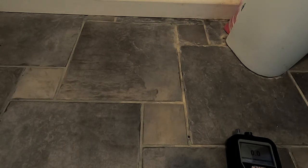When it comes to measuring moisture on concrete floors covered with these sorts of tiles, especially in a property that's been empty for a while or has no heating, or even a few years after a flood, one of the causes for concern would be the potential for condensation on the surface of those tiles, and we need to try and rule that out.